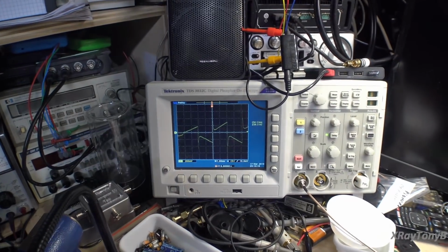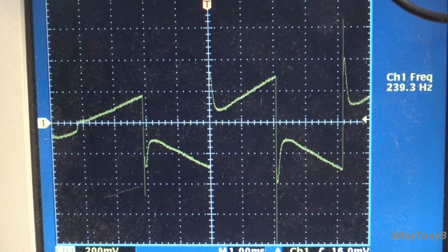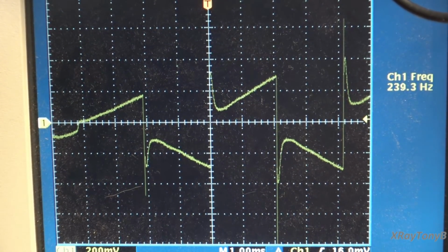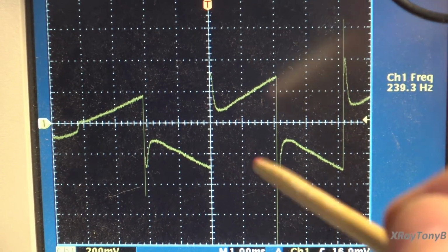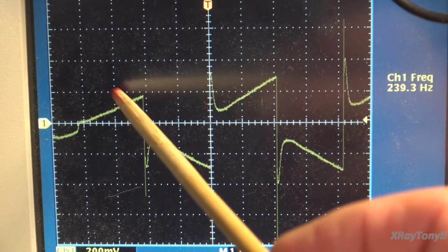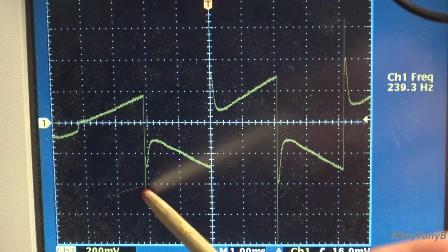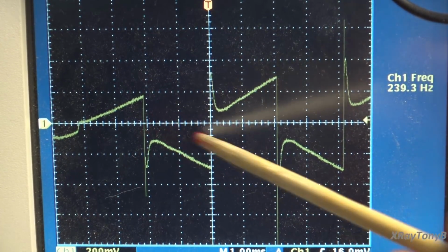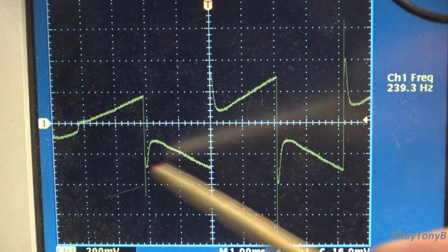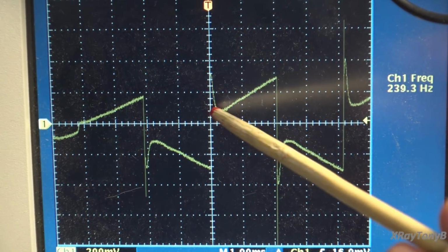Let's take the glare off and zoom in. You can see now that this is not a standard looking waveform. In order for an amplifier to properly reproduce this sound, there are some pretty rapid events taking place. If you look here, you have a ramp, then a very sudden drop in amplitude, and then this little spike right in here, see it? Then it comes back, ramps up, then ramps back down, there's a curve here, and then there's a very rapid rise in amplitude, and then a very rapid drop again.